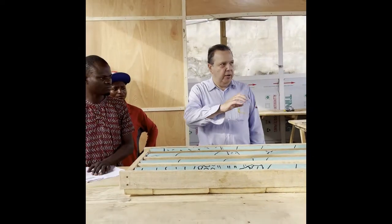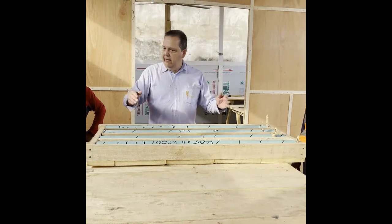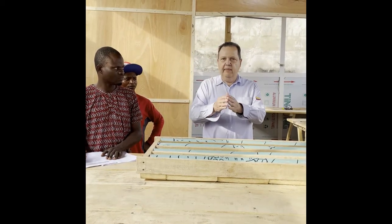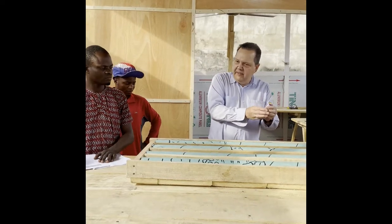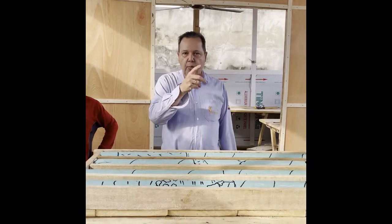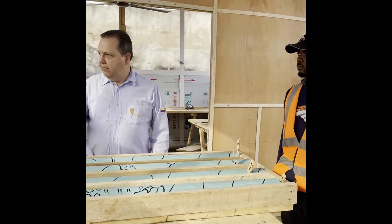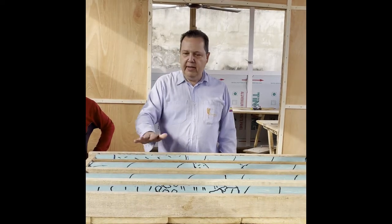Usually when the drillers make the hole, they drill for three meters at a time. So we will do the RQD for every three meters. We just determine how many of those three meters — how many centimeters are slightly broken, how many are broken, how many are very broken. With the formula and graphic that I sent you, which is in the Excel file you received for the portfolio, you do the estimation and you get the quotient.